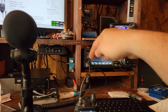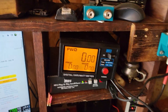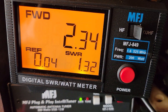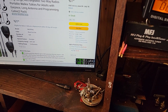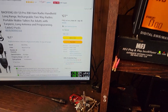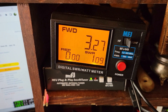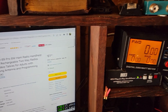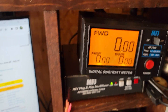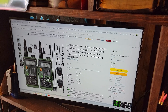If I hook it straight to the back it might do a little different. Let's hook straight into the back of it and see what happens. AK4PJ testing — 2.3 watts, supposed to be 5. That's on 440. Now on 2 meters: AK4PJ testing — 3.27 watts. SWR got a little better.